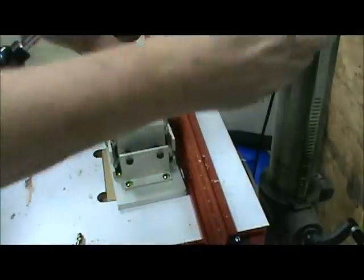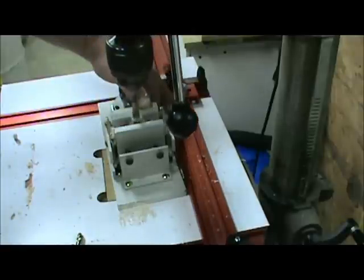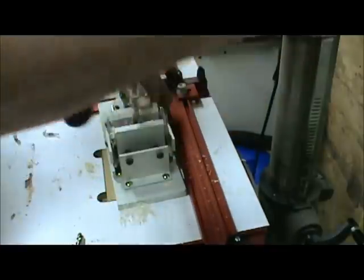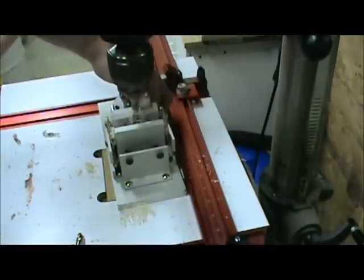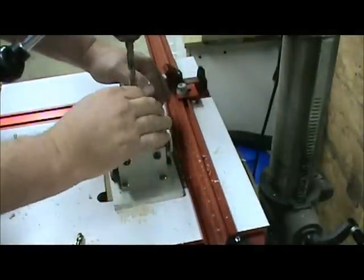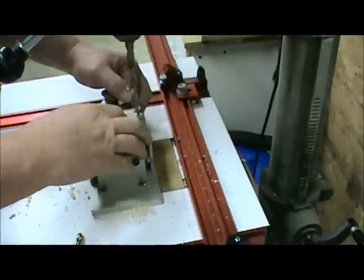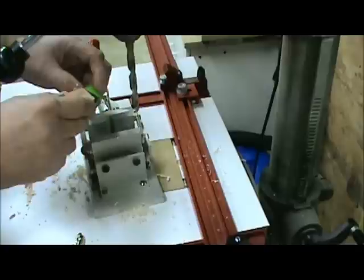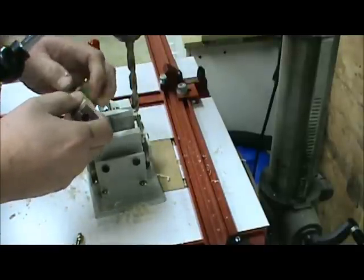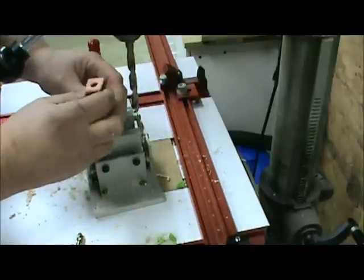Anytime you're drilling a polyester resin blank, you want to be careful about heat. So a good sharp, clean drill bit. There we go. We should be finished. You should be able to grab a hold of that bit when you're finished. If you can't grab a hold of that bit, then you overheated it and you probably melted the inside of your blank. So if you got one of those little hand drills, you try to drill this with a hand drill, you can't get it to go slow enough, you'll overheat the blank. You'll melt the resin and you'll have a mess.